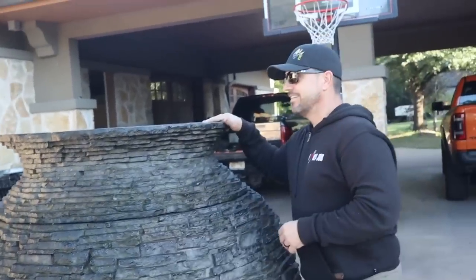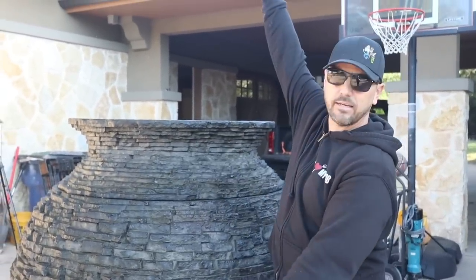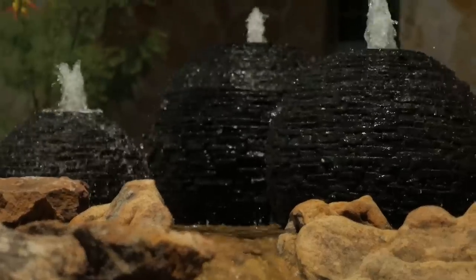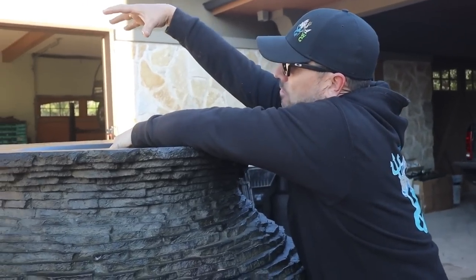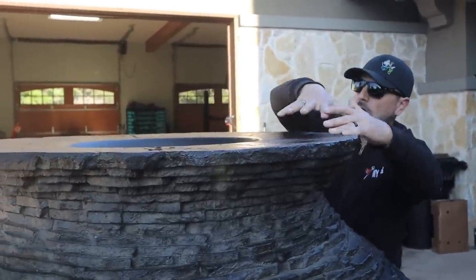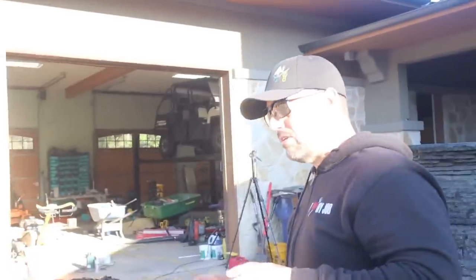We'll probably do some rock work and add some aquatic plants. Then from there, we've got beautiful Texas moss rock we're going to use to create waterfalls and pool outcroppings, building up to the section where the rest of the urn is. The urn is five feet in diameter and still about five feet tall even as the bottom third. We're going to run a big three-inch pipe up inside and reduce it down to the top to push water out like a jet. We've got a three-watt light we'll drill into the top - at night that huge column of water will look like it's on fire.